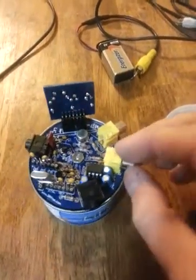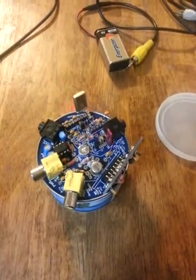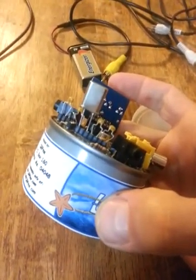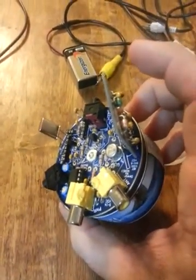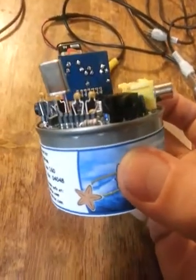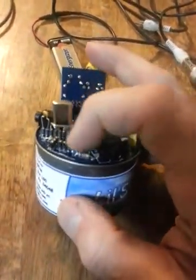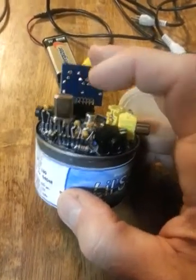The PCB is held in by just one screw. What you have is a crystal-controlled rig — here's your crystal — and I've got a 7.114 MHz crystal in there. Interestingly, it transmits at about 7.112.4. I double-checked all my capacitor values and they're correct, and I've metered everything. It always comes out to about 7.112.4. You've also got an SIP socket right here for your tank circuit parts.